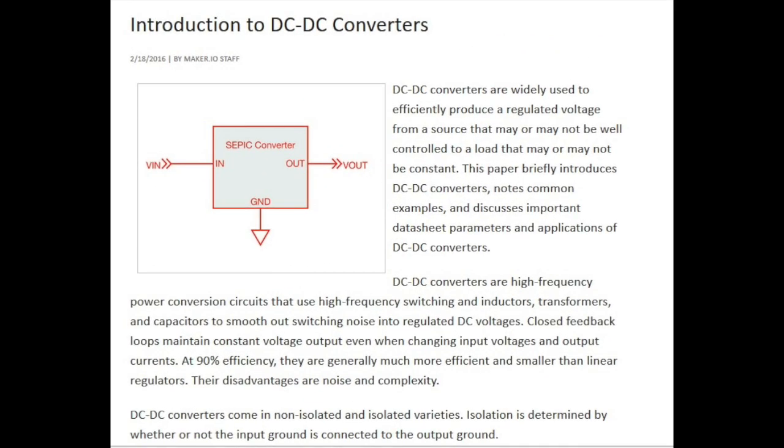I found this additional paper, also presented by DigiKey, that describes the difference between isolated and non-isolated DC to DC boost converters. That made it clear to me that the boost converter I was currently using was non-isolated, and that what I should seek is an isolated boost converter in order to adequately duplicate the floating circuit that exists when using the solar panel. I have also provided a link to the second paper in the description to this video.